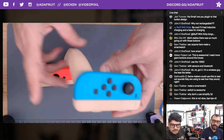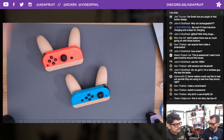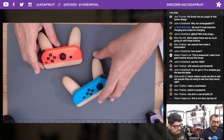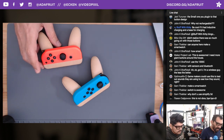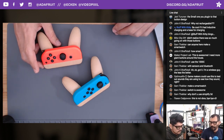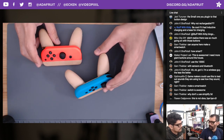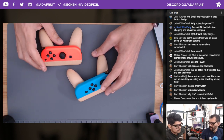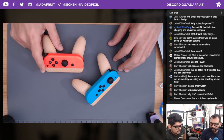Why don't we use Simplify 3D? Because we use these on the Ultimaker, and Ultimaker provides profiles for these that are continually tested, especially on the Ultimaker 3. I don't want to sit there and spend all this time building my own profile because those don't come with it. And that's why we're using Cura for that. Cura's free. I still use Simplify for the Type A's and the printer bots. So we use all of the slicers.